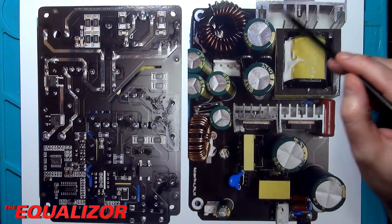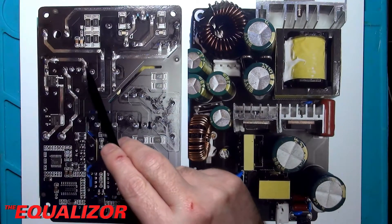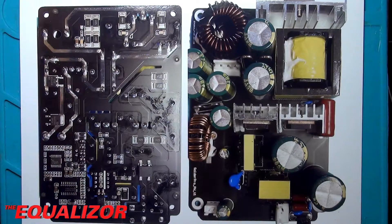I think this is generating the 24 volts for the C245 part of this station, which is this part of the connector here. And then we have another chip here, the LM25116, which is a synchronous buck controller. And this is controlling these two MOSFETs here, which are providing the 12 volt output that the C210 handle needs. It's quite a nice little power supply — it's based upon completely standard parts. They haven't lasered any of them off, so repairing it would probably be quite easy if needs be.